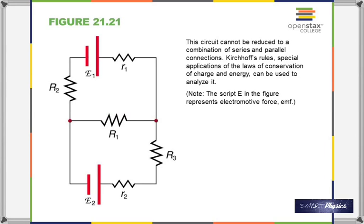All right, the second thing. This is called an electrical network. See, this is a closed electrical network. You see that? So how many closed networks can you see in this diagram? Two. No. Because the third one is the outer one. So the first two that you thought of when you said two are this and this. But there's also a third one, the outer one, which does not include R1.